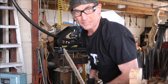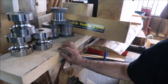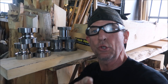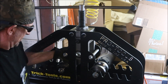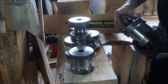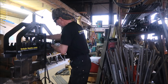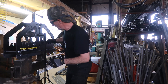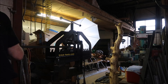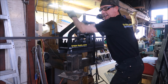Let's take a look at some of these other dies. In addition to the two-inch that we got, we have this inch-and-a-half, and we also got this two-inch square die for square tubing, rectangle tubing, even two-inch strap. Let's check that one out - just swap them out. Let's get a piece of this one-by-two and put a nice radius in it. Get a little tension on it, and here we go.